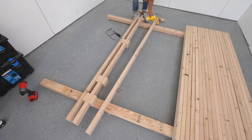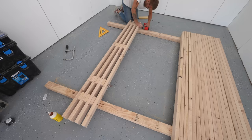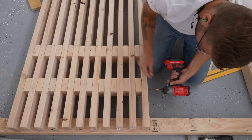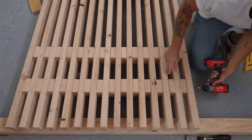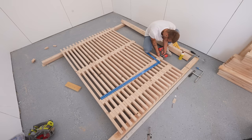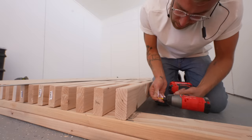I do want to be up front — even though this process is simple, it did take a long time. I spent an entire day just assembling this base, but I think it was worth it. On the foot side of the bed, the slats extend 9 inches past that last spacer, while on the headboard side there's only a 3.5 inch gap, the width of a 2x4. While I worked, I kept a 48 inch drywall square with me to make sure that the ends of all my slats met square along with all of my spacers. I gave myself about an eighth inch of margin, knowing nothing needed to be perfect.